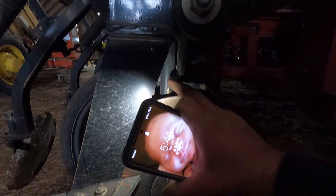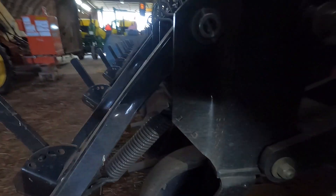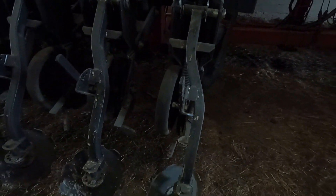So the tube will come down to the end here. The soybeans will come through this tube and down through here. Then there's a seed shaft right there. And this is the disc that's opening up the ground for the seeds to go in. And the seeds will come out of that tube right there. And then this piece keeps the seeds from bouncing right here. And then this little disc is spinning and closing up the seed trench.